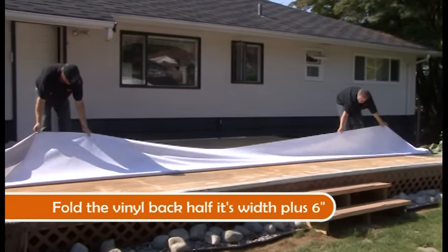This is because the adhesive will dry quicker on the plywood than it will on the vinyl backing. Now wait until the adhesive is tacky. Use the two-finger test and touch the back of the vinyl — if the glue is wet, it's not acceptable; if the glue feels sticky, the vinyl is ready to be put down. From the center of the vinyl, reach under and push the vinyl down onto the plywood. Use your hands to smooth and flatten the vinyl down as you go. Do not use any type of roller to do this, as it can stretch the vinyl. Smooth out any air bubbles that form. If you find a raised crease, lift the vinyl gently and push it back down again. You have one hour of readjusting time before the adhesive dries.